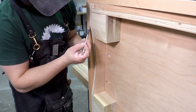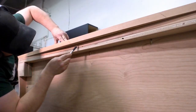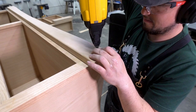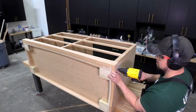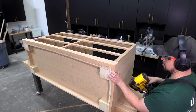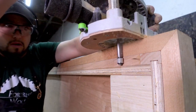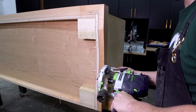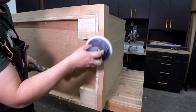I marked the curves with a pencil and rough cut them wide of the line on the bandsaw. I like using a pin nailer to temporarily mount them because the pins leave very small holes. And unfortunately, I can't follow the advice I gave earlier about routing curves. On these, I'm forced to route against the grain with the way I'm choosing, so I just go very slow and use a very sharp router bit that I will link in the description, followed by a quick sanding.